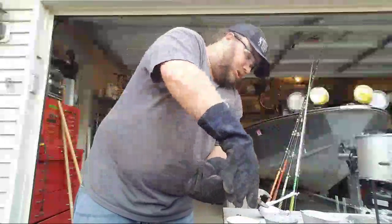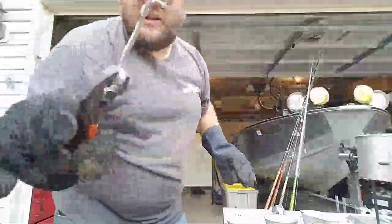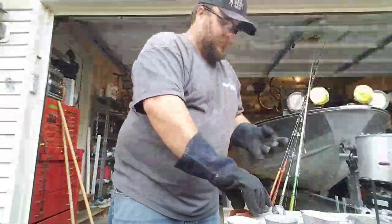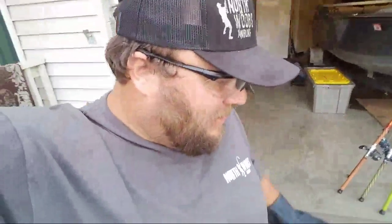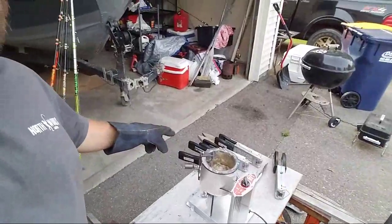I'll use that — it's probably the only 20 ounce I'm going to make tonight. These 20s are no joke, they stay pretty warm. Same thing as the smaller ones — grab the tag, grab the weight, throw the tag back in the lead. Now you've got yourself a brand new 400-degree hot lead ball, but that's why I'm wearing welding gloves. All this stuff — the molds, ladle — we get at Bottom Dwellers Tackle. Those are Do-It molds. It's all over there and it's pretty simple to make weights.